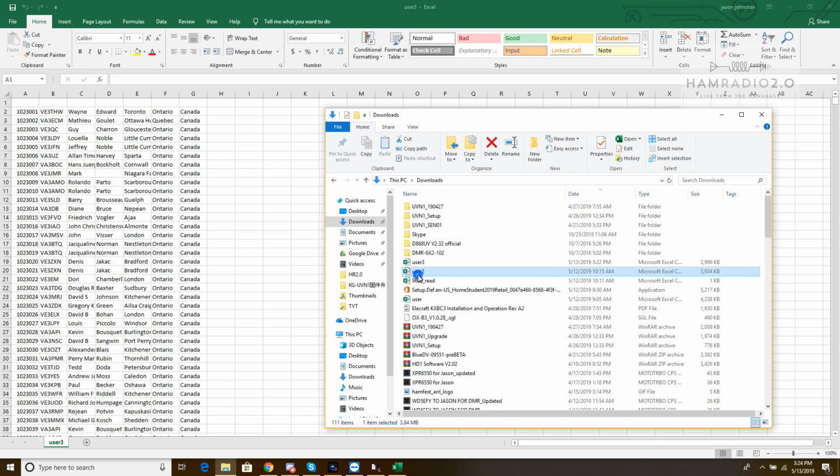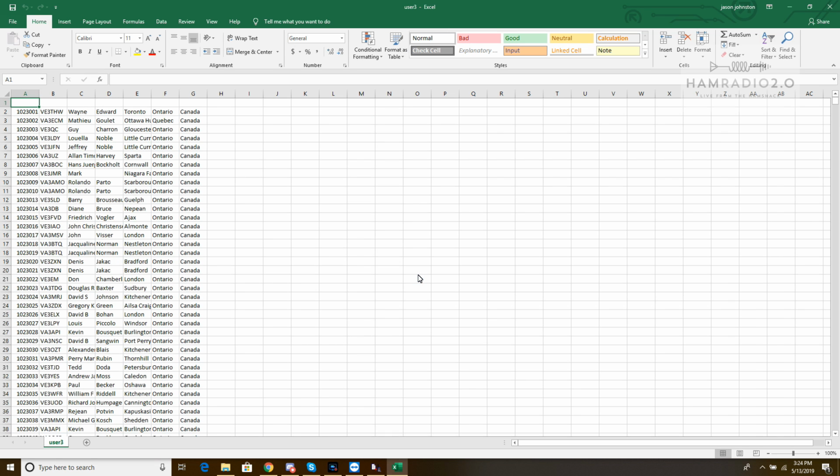So what I did was I opened up my TYT MD 2017 file, and I took this top row named radio ID, call sign, name, nickname, city, state, and country, just this one row, and pasted it into the user CSV file that I just downloaded, because it's a fresh file with all the contacts. Then I wrote it into the radio, and it worked. Okay, and now you just saw this is the file, user 3, here is what I just exported, and it should have 63,020 contacts also.